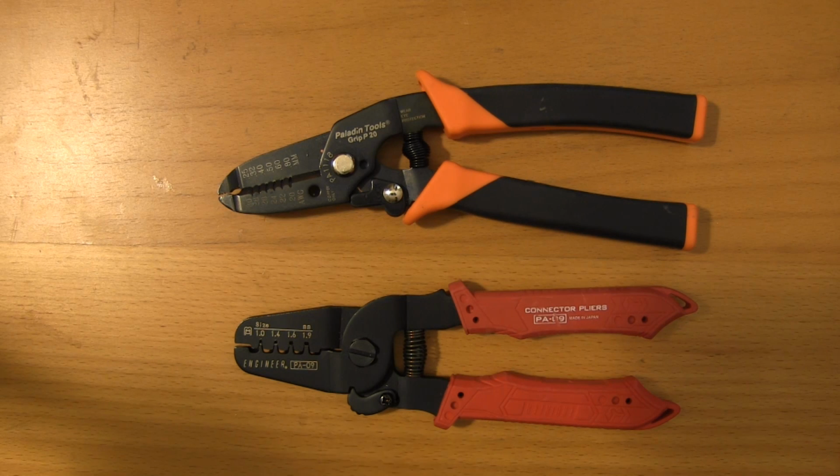This is something that I've been wanting to cover for a long time because this is one of those little black arts that allow me to do a lot of the things that I do with the FPV rigs that I have. An unfortunate reality of multi-rotors is that they are space constrained, and anytime you have a length of wire running across any of this, anywhere in the system, those have the potential for either emitting or receiving radiated energy from anywhere else in the system. The end result is you get a lot of noise, and really one of the best ways to combat that, as well as just in general how to neaten up your rig, is to do your own custom wiring harnesses.